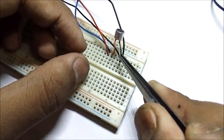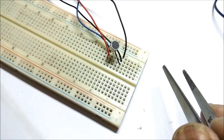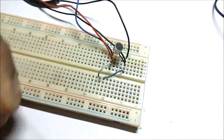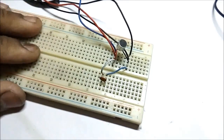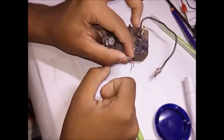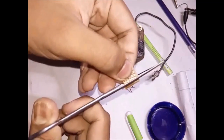Connect the microphone accordingly to the polarity. Now mount the 0.1 microfarad capacitor in parallel with the microphone. This is the circuit and now we are going to solder it to the veroboard. As it is an audio device and we generate signal frequencies, we need to keep every component as close as possible to avoid signal distortion.